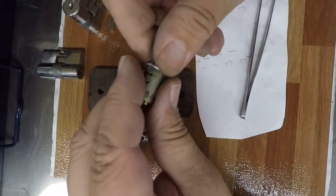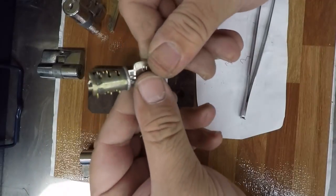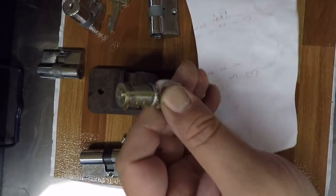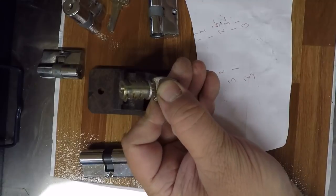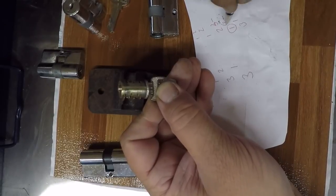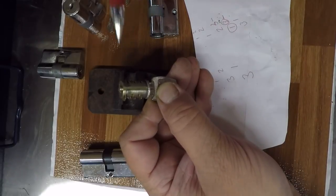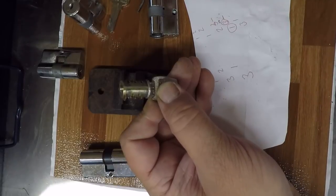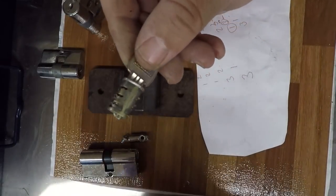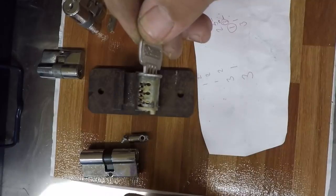All our discs are back in. I'll check they're all spring-loaded - yes, spring-loaded, yes. Putting my key in the right way, I can now check the configuration. On this side I can say a three and a one - so that matches what we had before. And now I have a one and a one, so that's a difference there. Then the next one has a two and a two - that's lower. Then ones and ones at the back. So I've basically juggled about three to four differences in there from pulling them apart, juggling them around, and putting them back.